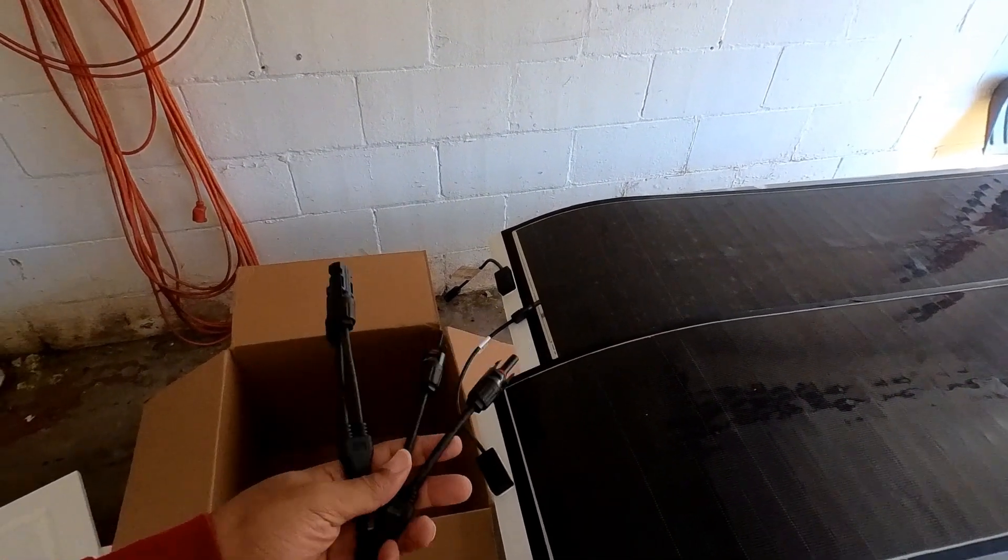Let's explain a couple of things here — 30 volts at like 3 amps. What I had in mind is I could parallel these panels, and I happen to have a couple sets of parallel cables. But with them being so far apart, I'm going to have to figure out some wizardry here. I'm thinking about putting them into a power station that can take in up to 30 volts — I think the EcoFlow may be able to take in 30 volts as well. Anything I have that can take in 30 volts, this will probably be right at that limit. I can put them in parallel, so it'll be 30 volts at like 6 amps. Or if I hooked them up in series, it would double to 60 volts at 3 amps. I feel like 30 volts at 3 amps can't be right because these are 70 watt panels — it's probably 30 volts at like 2-point-something amps.